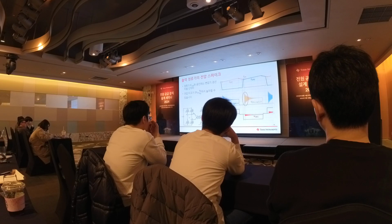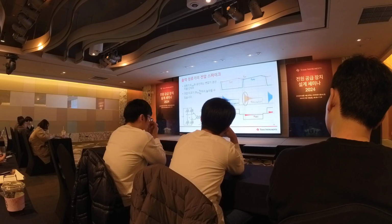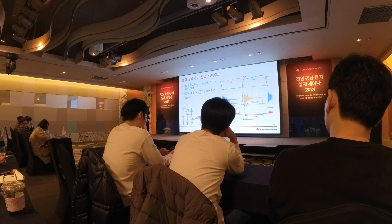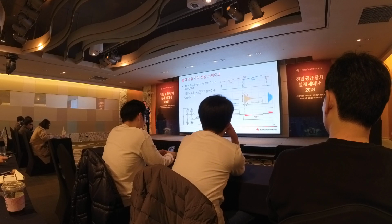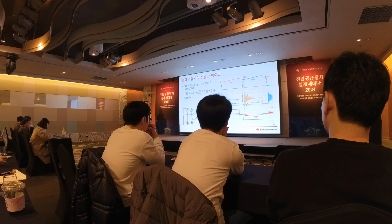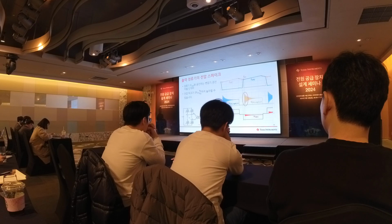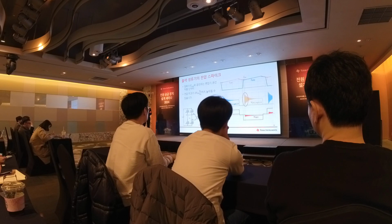If we don't have any clamping circuit or snubber to clamp the voltage, there will be a ringing oscillation formed by the LS and the COSS. And if there's no clamping circuit, that voltage can be 2 times the input voltage times the turns ratio on the output rectifier. In this model, only COSS and LS are modeled. If you consider that your rectifier body diode has a reverse recovery, this voltage will only go higher, right?